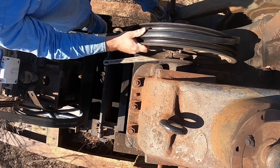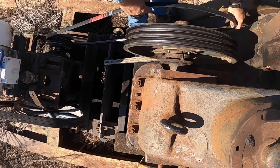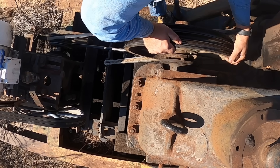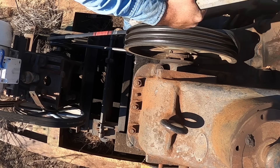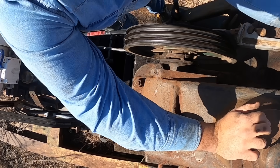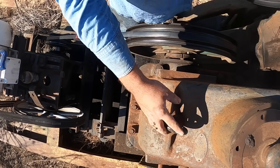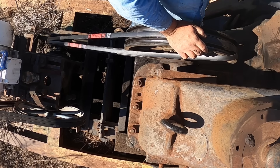What I always do is jump on this side of the weight — this causes the unit to roll a little bit. I'll start with the middle belt, turn it as far as I can with my hand, then take a pipe wrench and bite up against that belt to keep it from coming out of the groove. Give it about all I got and it'll go on there. It's a good way to lose a finger, which I have. It's not that big a deal — it just cost a lot of money.